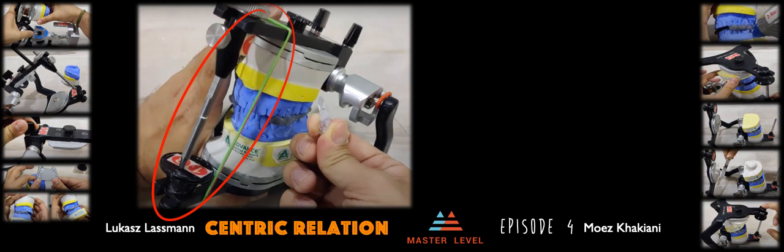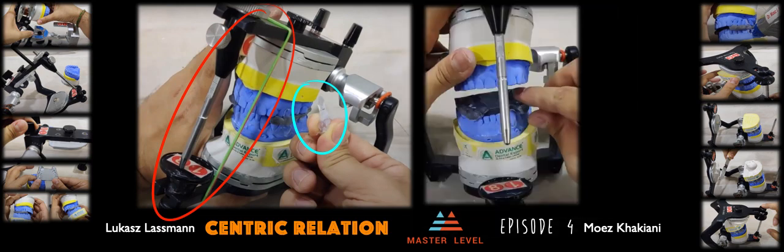Once again, a nice clean assembly. Once everything is set, please go ahead and remove all of these glue sticks — they easily peel off and don't leave a residue, which is the reason I love them so much. Earlier, we used to use sticky wax — I don't like it. It's very tacky, very sticky, as the name says. And worst case scenario, if that wax were to touch my skin, I have a lifelong memory with me. Glue sticks work perfectly well.